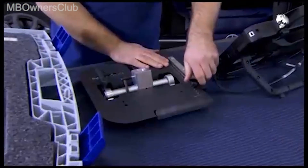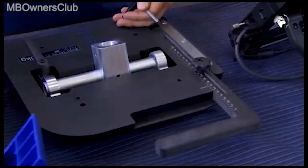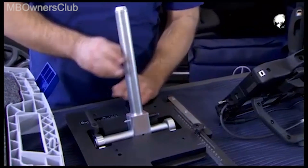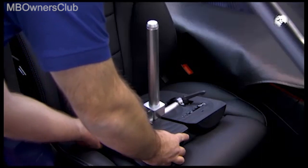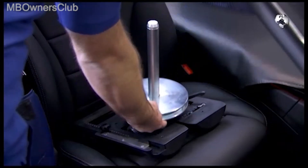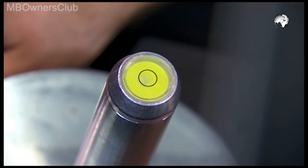For the teaching process of the control unit you need a test case. Set the distance to 70 millimeters, then bring the tube for the weights onto the base support. Note that the base support weighs five kilograms. For the first step, put an additional 10 kilograms on the base support so there is a total of 15 kilograms on the seat. The bullseye level must be level throughout the test.